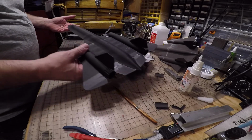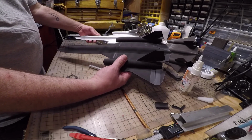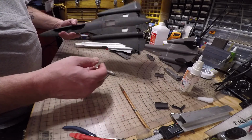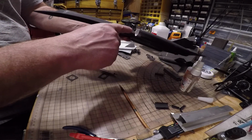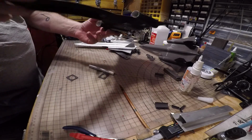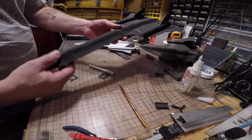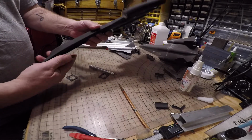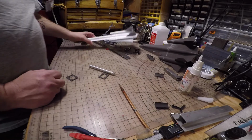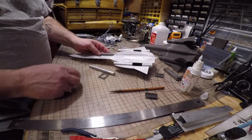This was my first version. You can see it's a lot bigger. It's printed with a 0.6 nozzle. This weighs a lot more than this. It's a carbon rod. I was using that much control surface, which you didn't need. But you can see the warping, that was because it melted in the sun. So this airframe looks like crap now. And it was white. I painted it black. You can see where I had everything cut out for the battery pack. So it wasn't good. It needed more powerful motors. That's why I built a smaller frame like this. Better flight characteristics.